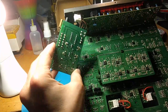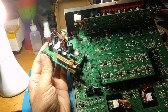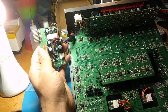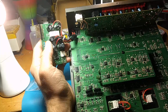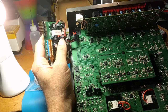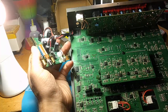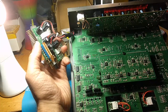If you look at this power supply board, you might think, well, it's not that beefy. Actually, these wires go to some TO220 package voltage regulators, likely 15 volt. I think they're 7815s, a really common linear voltage regulator. What's really cool here is they wired them in and put them on the case instead of having them here. Either they did that or I did that. I think they did that. Nah, it looks pretty clean and the wiring matches really well.